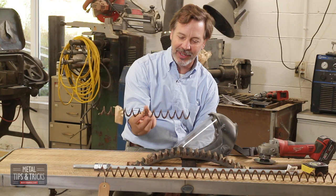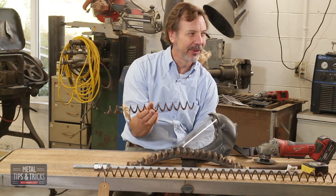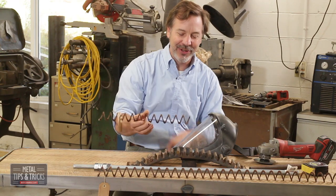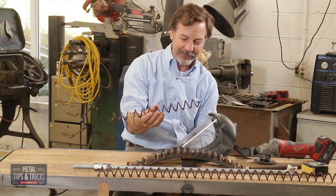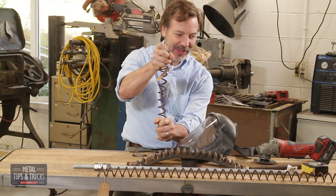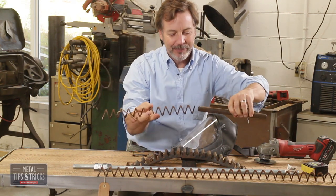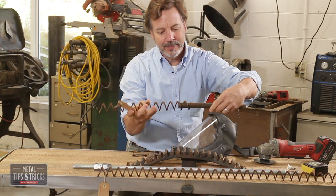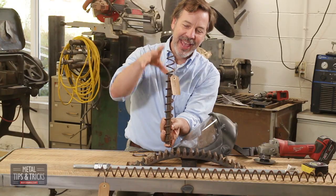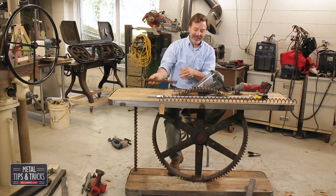And these are actually not springs, they're coils, they're feeders. They put them down these big long troughs to feed chickens, and as they turn, they bring the feed down to them. And I thought that was a great idea. The problem is they are flexible, so we're going to take a pipe, put them in the middle, and that's going to give the rigidity, and then the pipe will be mounted in the four corners. And I think it's a great balance.